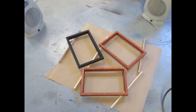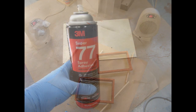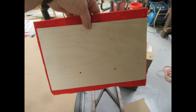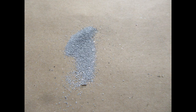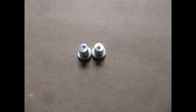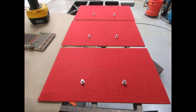I decided to paint and/or stain and lacquer the inner surfaces and backs of the frames. I'm using some red felt in these frames, and I'm using 3M Super 77 spray adhesive to adhere the felt to the plywood — and when it was dry I cut it to fit the wood precisely. Two of the large diameter posts I drilled through all the way by accident, so I used some aluminum filings and epoxy to fill the holes, then sanded and filed them — they're not perfect but acceptable. Here are all six of the larger diameter posts screwed onto their plywood back panels through the felt.